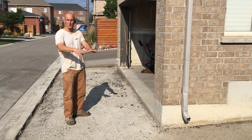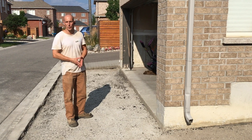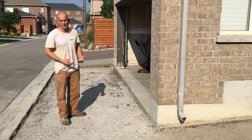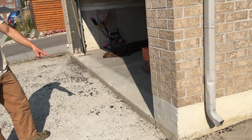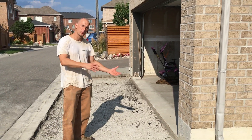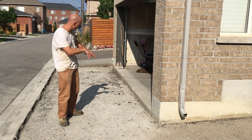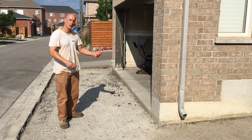We've got the asphalt removed. We just got back from the asphalt plant after dumping it and picked up some granular A gravel so we can apply it down on the ground and prep it before paving next week. If you look, you can see the lip of the concrete here — it's about five or six inches deep because we've taken up two or three layers of asphalt in this section. We're just going to screen the entire area, especially more in this area, and then apply the asphalt once it's compacted.